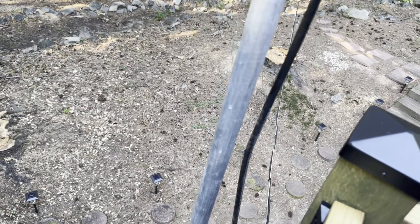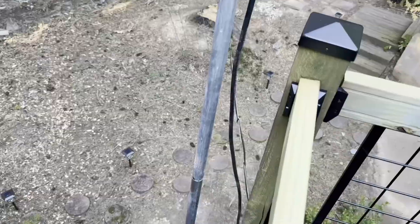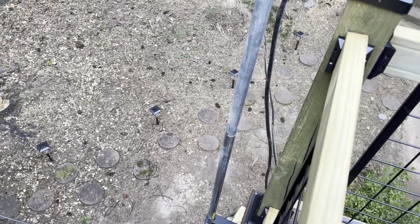So what I did in the previous video, I just put one section in and got the antenna up about 10 feet off the deck. So I had the antenna up probably 28 feet to the base. Two five-foot sections is 10 feet plus the height of the deck would be 31, minus a couple of feet for the brackets — so I just added the second five-foot section. Now it's going to be up around 33 feet.